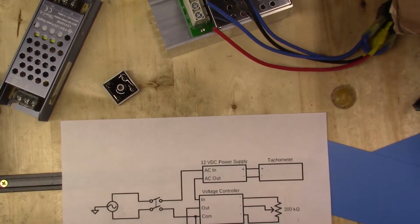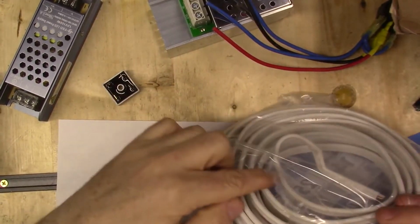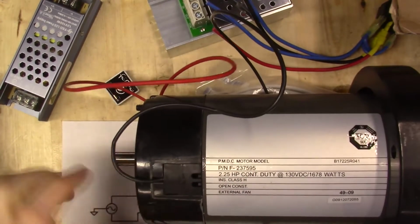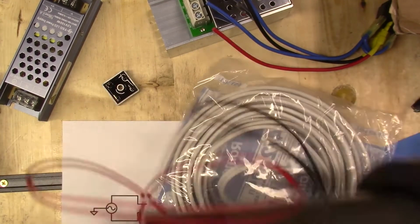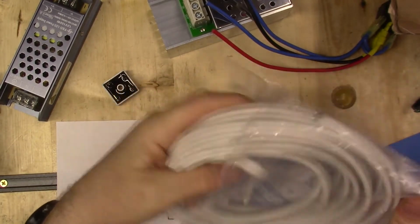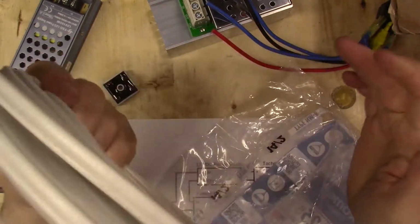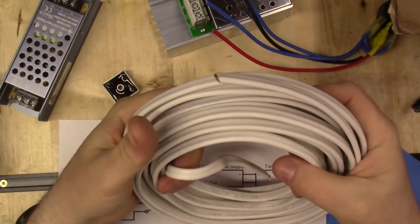Also, before I forget, the wiring I'll be using is just standard house wiring. The motor is rated at 15 amps, I believe. It doesn't say, but I think the motor was rated at max 15 amps, which I don't think I'll ever get it that high. But I'm using standard household power wires that I will take the wires out and use for a lot of the wiring. That way I know it's not going to burn out the wiring by drawing too much power.